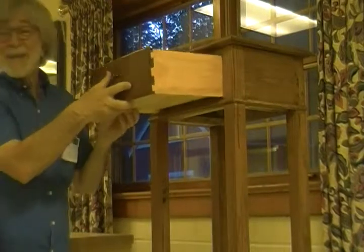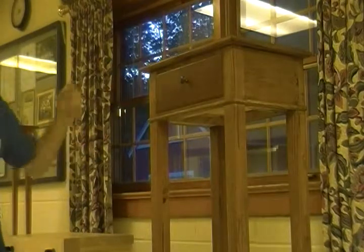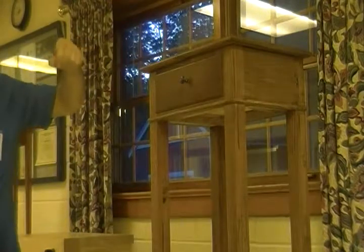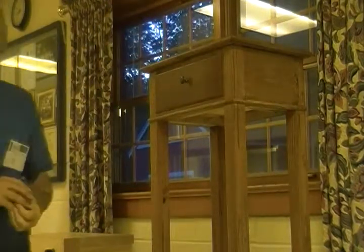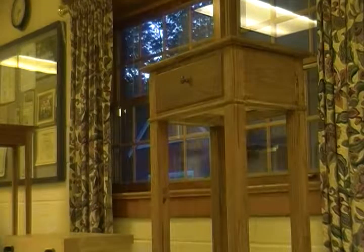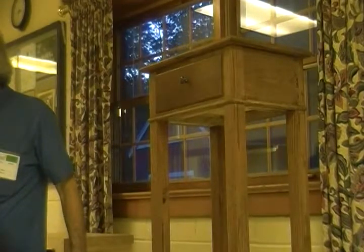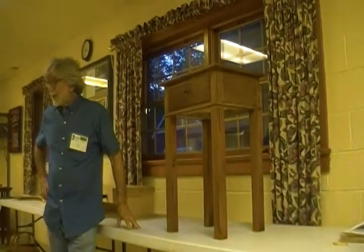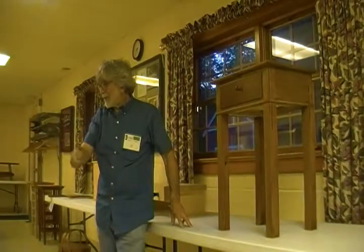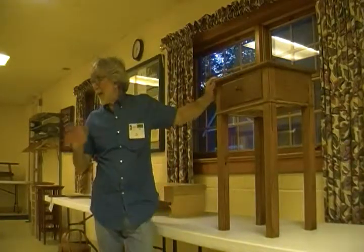Stain, and can anybody guess the finish? And then I wax it. And it's the height of the mattress, so it holds a nice lamp. And everybody's happy with it. When the shellac dries, which doesn't take long, do you steel wool it down, or do you use a fine sandpaper? Just 4-0 steel wool. I put the steel wool right in a can of wax and rub it out. There's about 3 coats of shellac. I don't sand in between the coats.